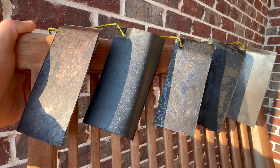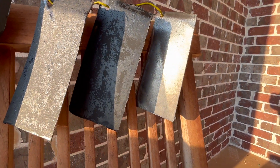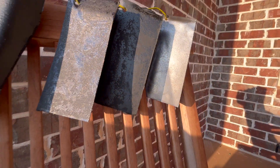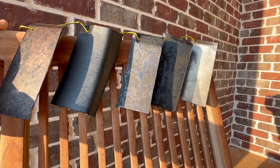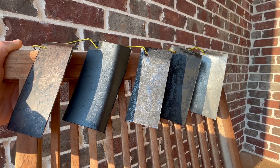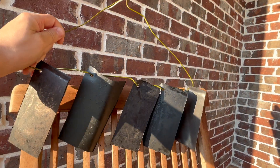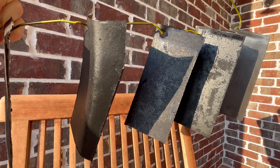It's been just overnight, a little less than 12 hours, and as expected you don't see much change on the treated plates. But with the glare of the sunrise it might be hard to see — there's some initial surface rust forming on the control piece. From here on out I'm going to come out every morning, possibly accelerate things with a salt spray, and record as I go. That'll be the next part of this video to see how these rust converters and the Eastwood rust encapsulator hold up over time.